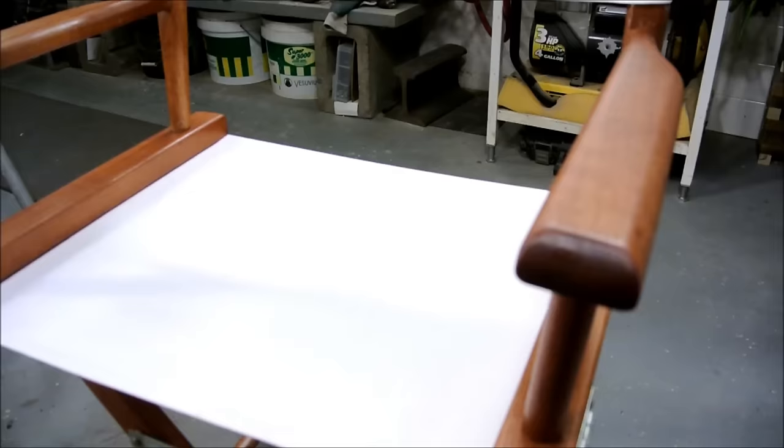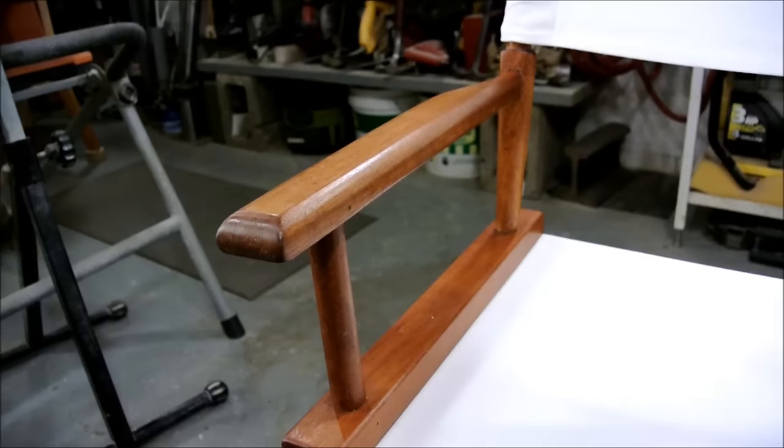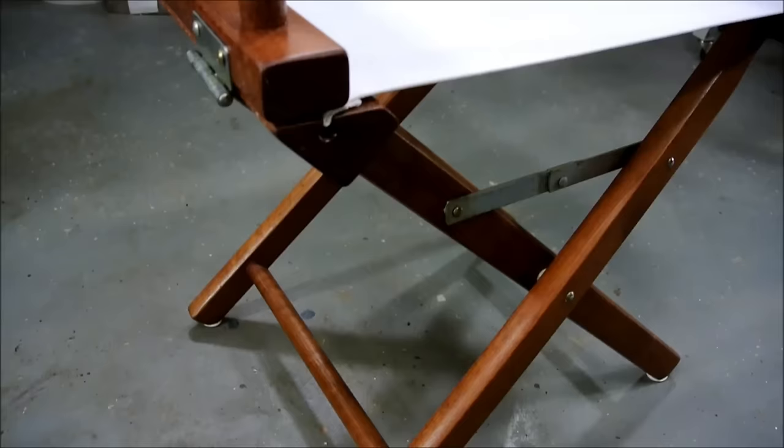No stain was added. I sanded it down to 100 grit and then gave it two coats of teak oil. After the teak oil was mostly dry, I sanded it lightly with something like 400 grit. And then I used car wax — I use that a lot on wood. Rag it off and it gives it this kind of satiny feel and appearance.